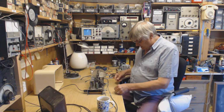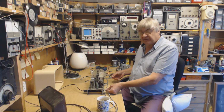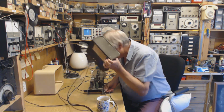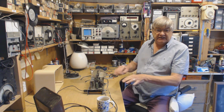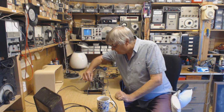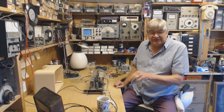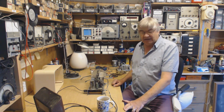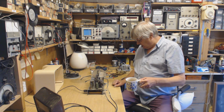Right, here we go. This is the ivory one that I've had the estimate accepted. Do you think that's working all right? Haven't done the capacitors yet. Just listen out for that output transformer. Little bit of crackling. I don't think it's that though. I took the valves out, as you do, to clean them. Clean the glass, the bottle itself, and also the valve bases. And the radio didn't work afterwards. What's going on here? I got two of them round the wrong way. Can you believe it? See, even I do that. I just line them up on the bench, I don't look at the type numbers. Just line them up on the bench, put them back in. I didn't even look. You see, complacency. There we are. Shouldn't do that.